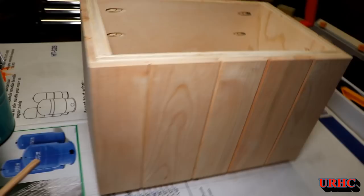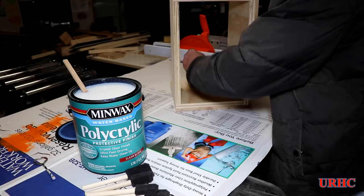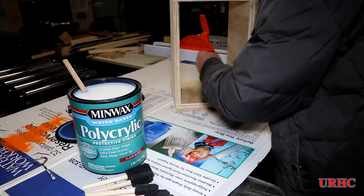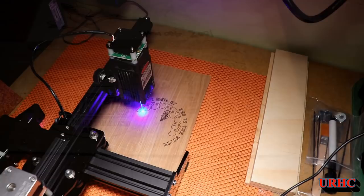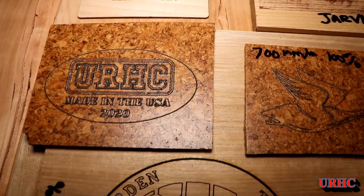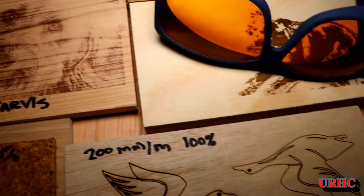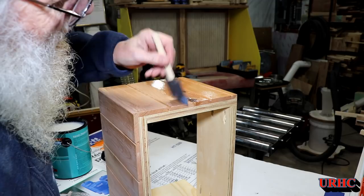There's the little pedestal, all ready to pretty much be installed. I decided to go with Polycrylic on this whole project — I really hate this stuff, but it's the only thing my wife can stand the smell of, since any oil-based finish gets up in the house. Meanwhile, I'm still playing with that little laser, working out settings and doing samples while waiting for the poly to dry. I've been having pretty good luck with most everything except photos — turns out there's a problem with their firmware that should be updated shortly. I went through and did three coats on everything, with 320-grit sanding between each coat, then a final sanding and some wax.